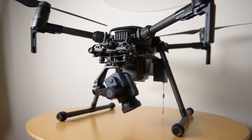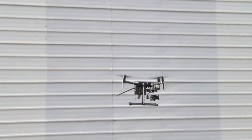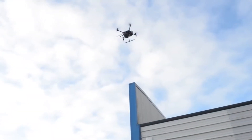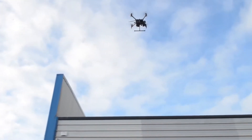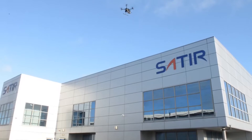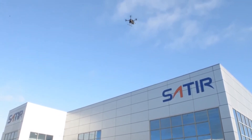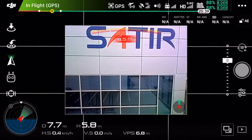who are the world leaders in drone technology. The thermal core payload weight is 2.34kg with the standard battery and 1.61kg with the optional battery. The maximum flight time with the standard battery, with a take-off weight of 6.14kg, is 13 minutes. The flight time can be increased to 24 minutes with the option of higher capacity batteries.